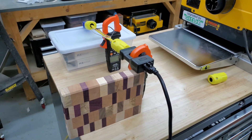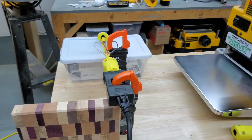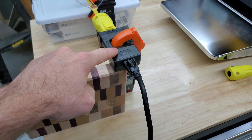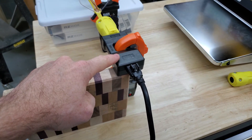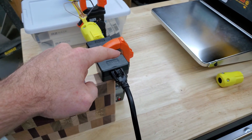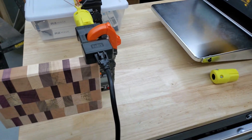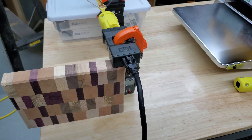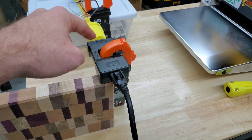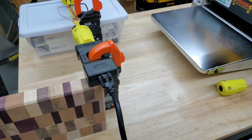Now, I know this isn't entirely intuitive with some of the measurements on this, so I'm going to use two different meters this time. In the original setup, I had this line splitter on there. The purpose of the line splitter is just to separate the neutral and the hot wire, because if you were to measure both of them together on the cord, you would just end up with a reading of zero on the meter. So this separates the two wires, and this one has 10 loops in there for better accuracy.